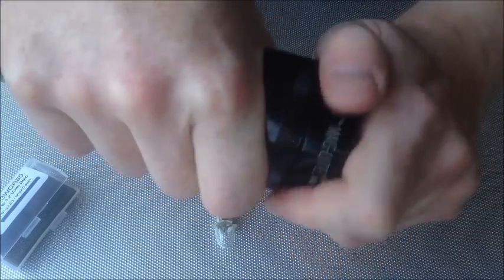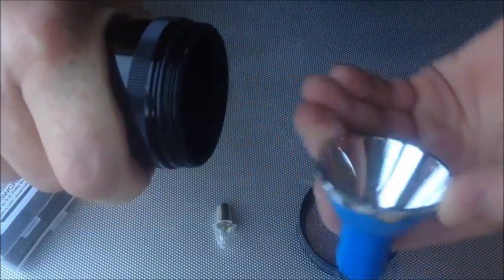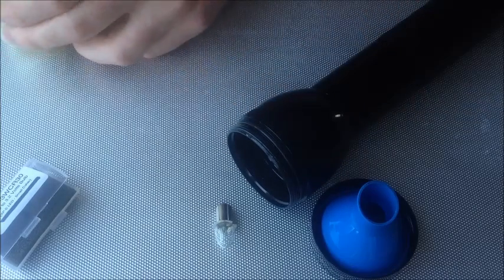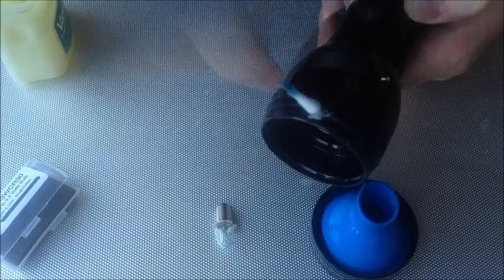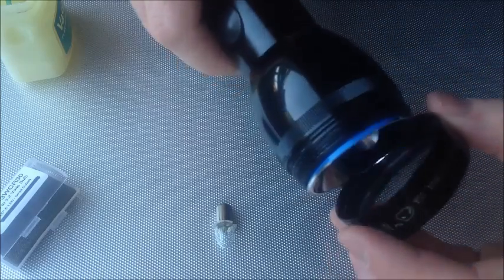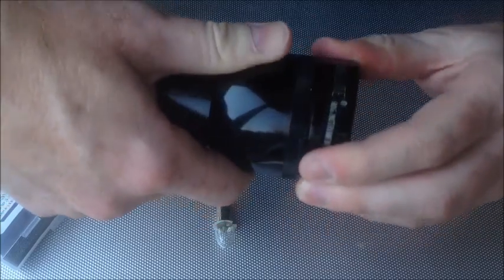These also have the O-ring — you can hear the squeak, this has never been done before so it's very dry. Out comes the glass, out comes the reflector, and there again you've got the O-ring and some more thread. Just get a bit more Vaseline and do the same again. Put the reflector back on and the lens — that goes on a lot smoother and there's no squeaking. Okay, just wipe off the excess Vaseline.